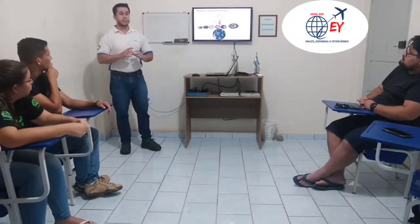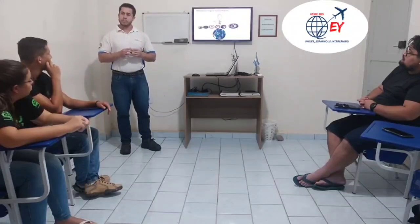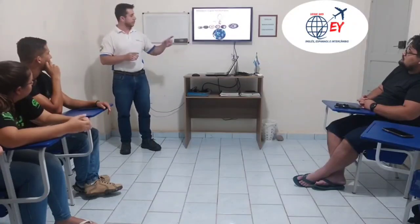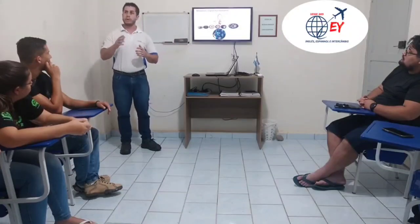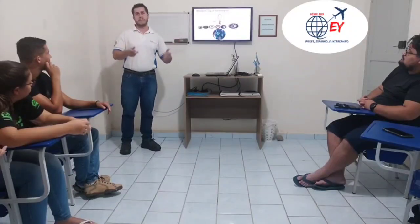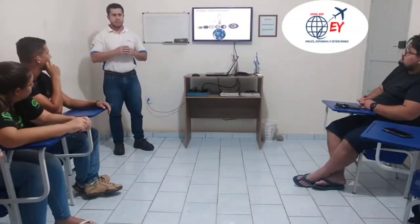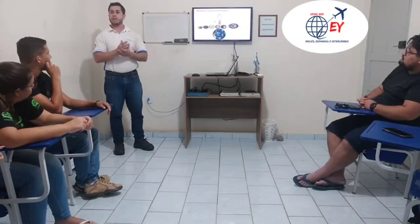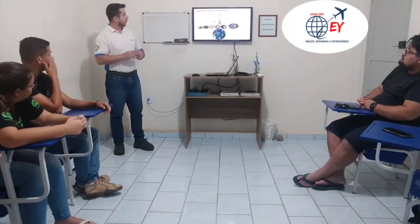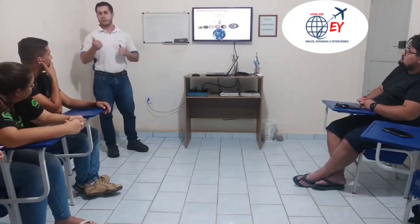It is important for manufacturing the wheel that in all the operations you have statistical control of all the process. In the disc process, you have around 300 control characteristics. In the lamination process, you have around 200 characteristics. And in the assembly line, many important characteristics about the arc weld process, such as penetration and many others. For me, it is very important in our company.